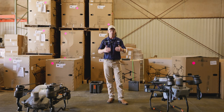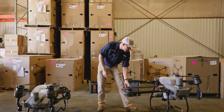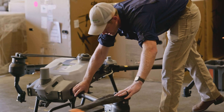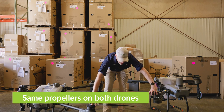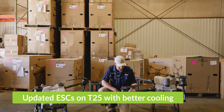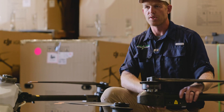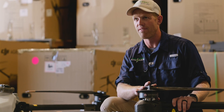Let's get into a bit more of the hardware. We'll fold these drones out and take a look. They both fold out exactly the same — both quadcopters with four arms, four props, four motors, four ESCs. The outsides are the same, and the props are actually exactly the same on both of these. The ESCs are different though: the T25 has an upgraded, bigger ESC with more cooling fins on the bottom — about three or four inches worth of cooling fins versus about an inch on the T20P — meaning reliability on the power system with the T25 is going to be better.